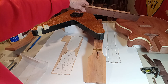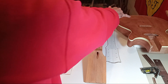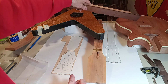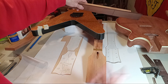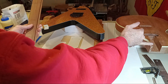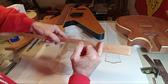You're working from a very determined point from the very front end, and once you define that point you build the guitar based on that one point. On this guitar it's based on the tailpiece stud and anchor location. Now that doesn't mean I can't change that location — it's basically a half-inch hole, I could move it seven-sixteenths of an inch — but I don't want to keep re-engineering the job. When you build this guitar traditionally, you want that 16th fret to land perfectly over the body join.